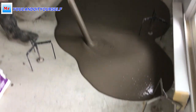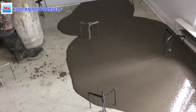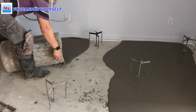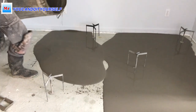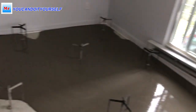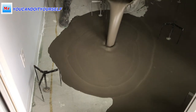For this room I used six bags of self-leveling compound. The main idea is that when you pour the compound, it should reach the bottom plate of the tripod — you can see the round plate in the middle. It should not be higher than that bottom plate. You don't need any extra measurement tools; it's already very easy to see how to do it.